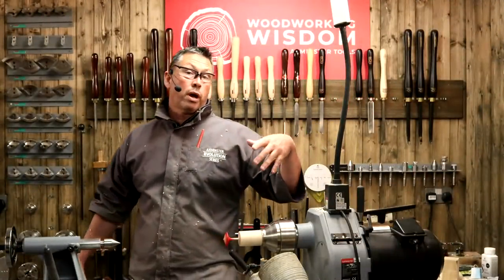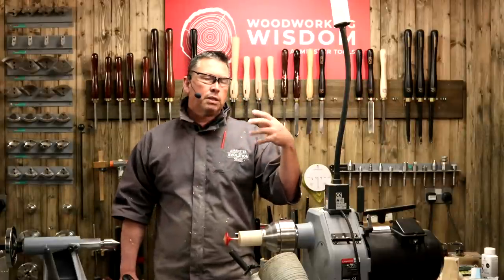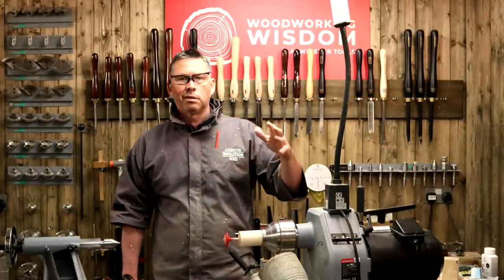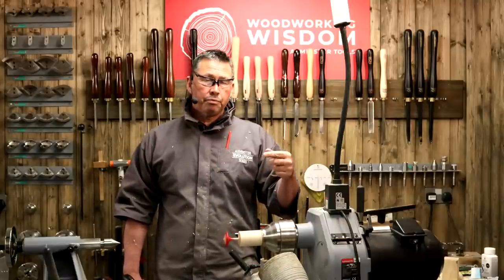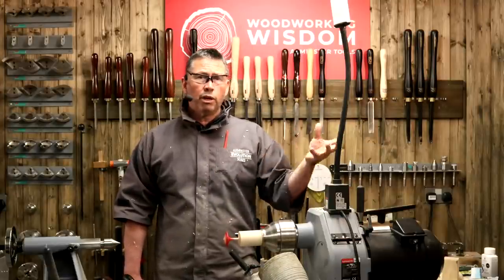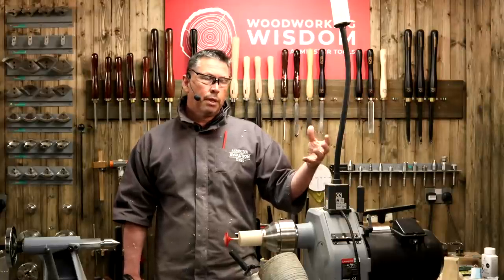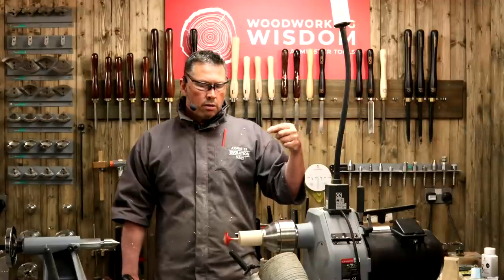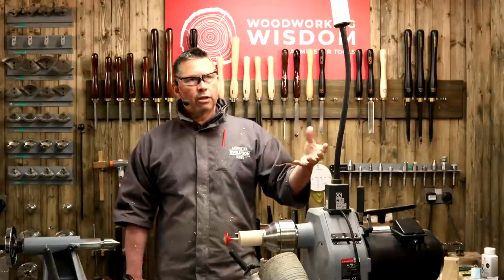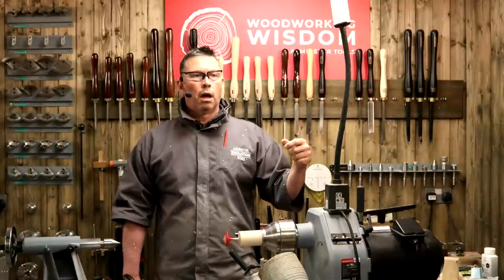They're going to be quite dry and quite dusty, quite hard. So I quite like air dry timbers because they don't go down quite as extreme. The other thing to bear in mind, the kiln dry timber, the minute you leave it out in the atmosphere outside this time of year in the UK, it's quite damp. It will start absorbing moisture as well. So I tend to go air dry timbers for me better, anything from 15% down.